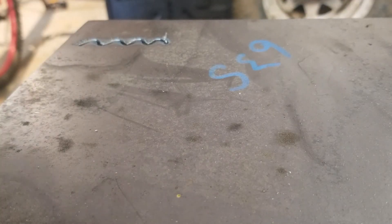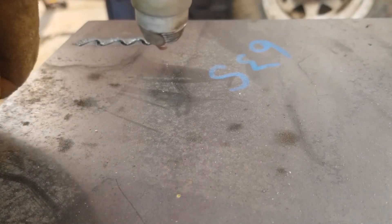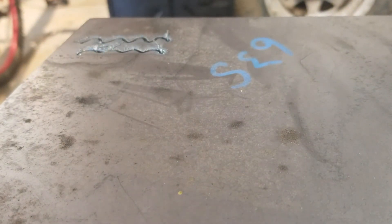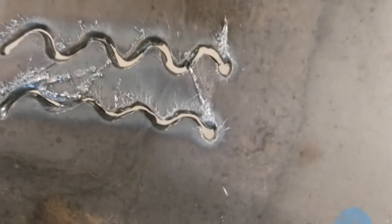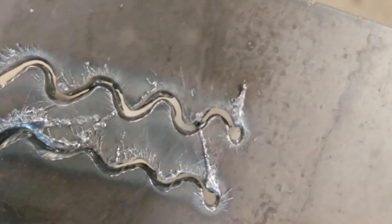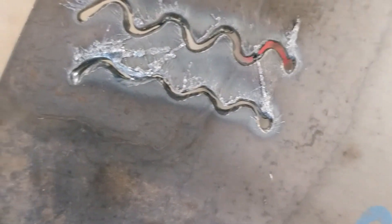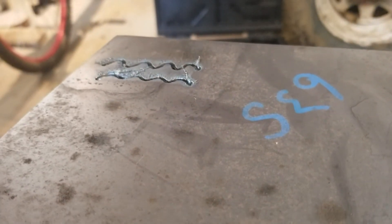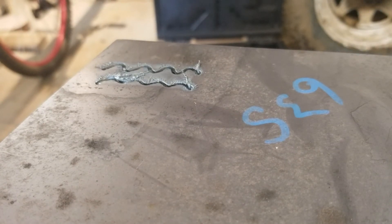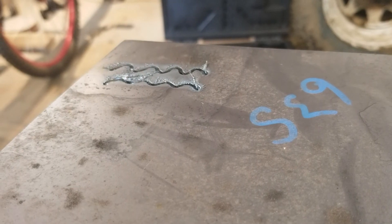Time to try it again — I'll kind of speed up as I go and see how it does. The Everlast stuff, even though it has a larger orifice, it looks like it actually makes a narrower cut. Again I sped up to the point where it kind of stopped cutting all the way through. But with that Everlast consumable it seemed like it took a little bit longer to pierce through. I'm still at 20 amps so it would probably pierce a bit quicker if I had the amperage turned up a bit more.